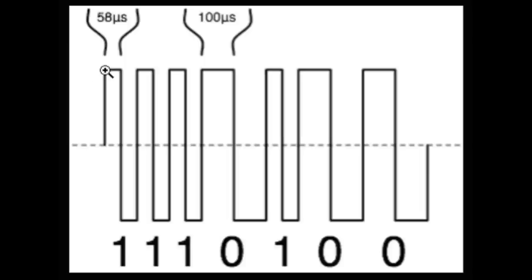When you get to larger layouts, you have to be concerned with things like twisting your wires or at least using something called zip cord so that you don't have data transmission errors. Another big concern is that with most power packs, you're maxing out at maybe an amp, whereas with DCC you're up at three, five, or eight amps. That's a lot more power going through your wires and rails, which has implications for how you wire — you need to make sure you have large enough wire done properly in order to not degrade the power or affect the data structure built into the DCC power signal.